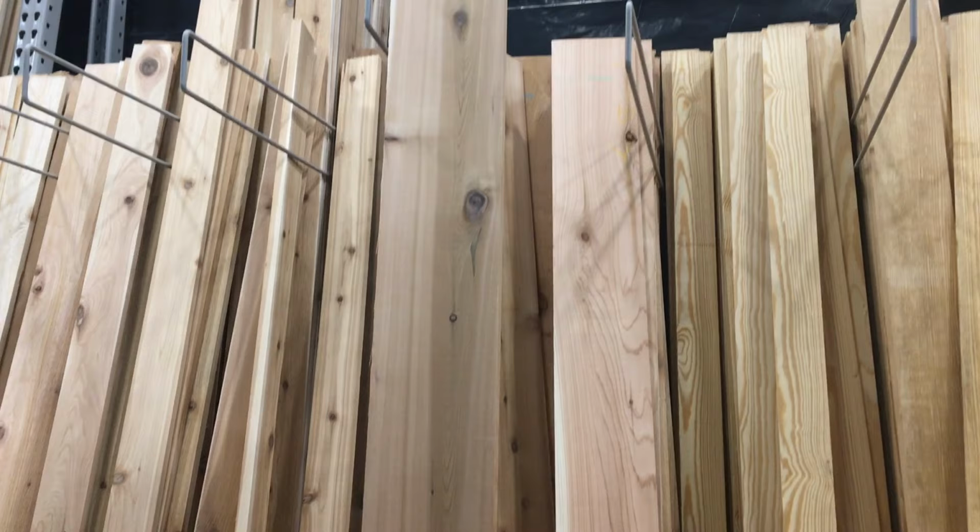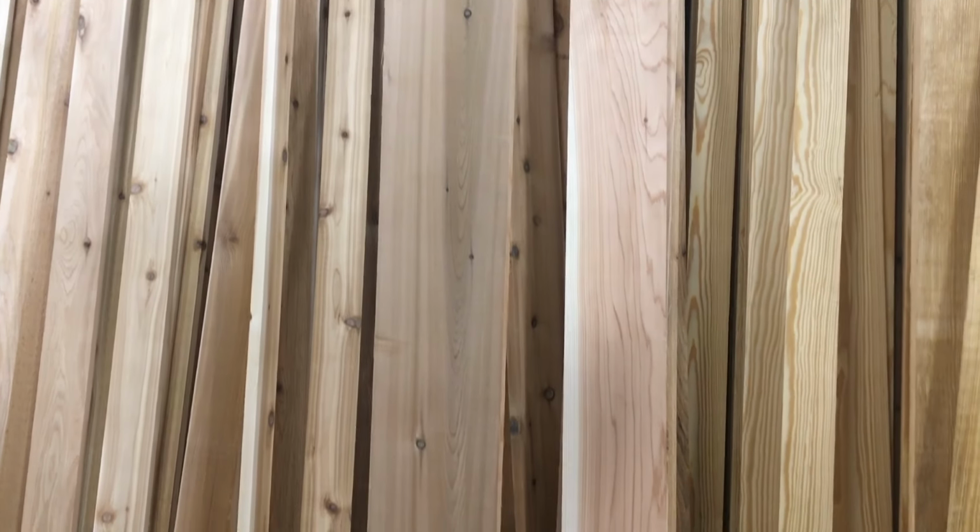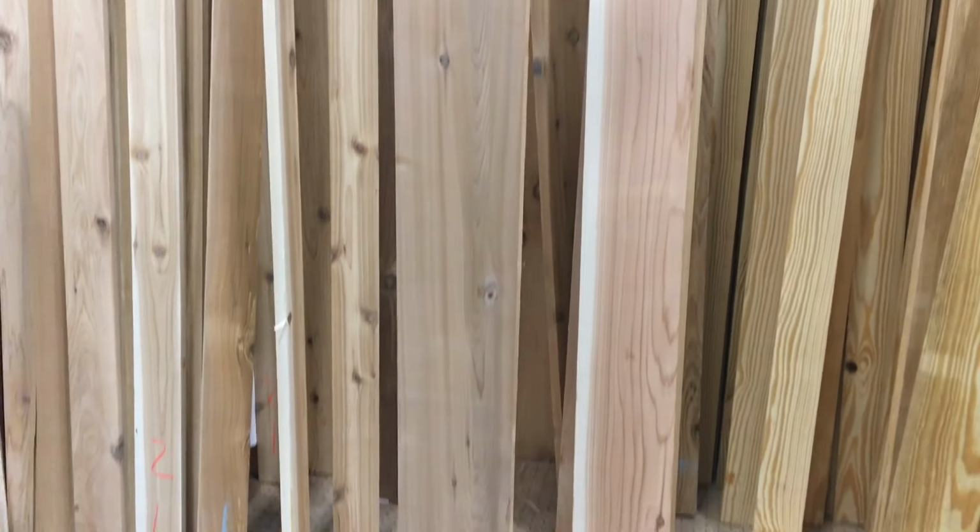Begin by gathering all of your materials. You can get a full material list and tutorial on my blog, but for the wood for this project, you're going to need a 1x8 or a 1x10 wood board. I chose to use cedar wood for this project because cedar is a more naturally weather resistant wood, so although it costs a little bit more, it's going to last a lot longer than another wood like pine wood. Also, because it is a naturally weather resistant wood, you don't have to use a sealant on it like a polyurethane, so it's one less step that you have to do.